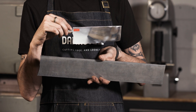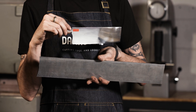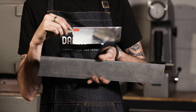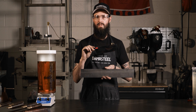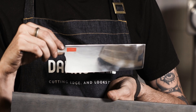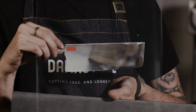Today we're going to be etching this Damasteel Nakiri, which we made out of the Grosser Rosen pattern. Here's what the steel looks like when we received it. Then we cut the steel pattern out, put it through heat treatment, and then finished it. We've ground this knife from 36 grit all the way up to 2500 grit, then buffed it with a pink buff and a green buff, so now it has a nice mirror finish and it's ready to etch.